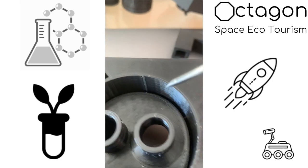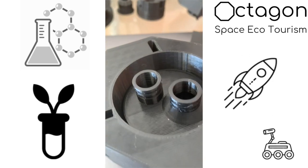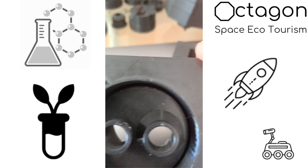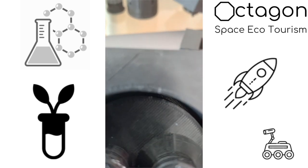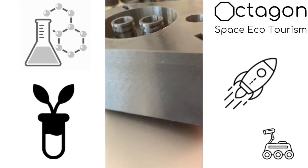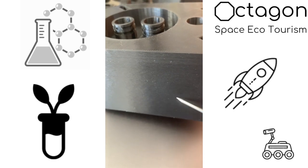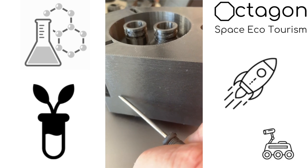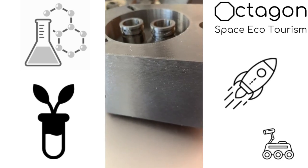What do I mean by a cylinder wall? If you look in here, you've got a little crack here all the way around, and that's for the cooling to come up. Okay, and that only goes down halfway down the sidewall. So if you see, there's a bottom there. It's not down here, it's actually up here. And we have all the fluid coming in from the side, wrapping around the outer perimeter of the cylinder, then going up through a crack on this side, and then it'll come back around the other side.